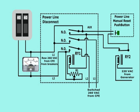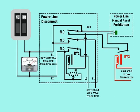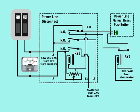An alternating current voltmeter, panel type, with a full scale of 300 volts, must be installed at the output of the main switch in order to monitor the status of the power grid. If that voltmeter shows a reading of 260 volts alternating current for a reasonable amount of time, indicating that the power grid power is back and stabilized, the user will need to shut down the generator, thus enabling the reset button, so the coil will close all contacts in contactor RY1, and it becomes locked again.